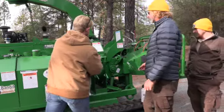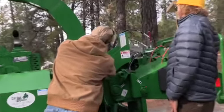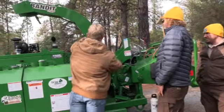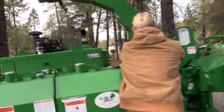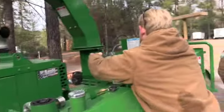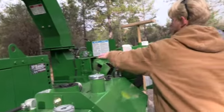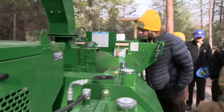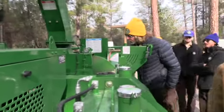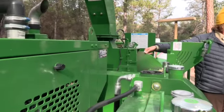Okay, perfect. So, little gold key up top, guys, is opened up by the little gold key on the key lock. That comes up. Again, hood pin safety device unplugs. You push this handle down, pull that bar. That's going to allow you to open that up. Now, when you do that, guys, you're going to see there's a grease point on that bearing, so that's going to need to be hit every day. Again, 8 hours, 10 shots. Got it? 10 shots? Yep.